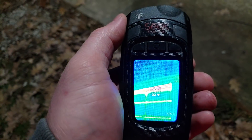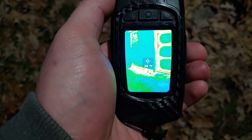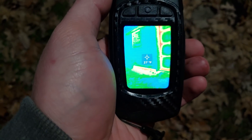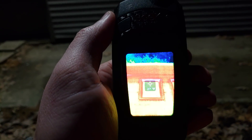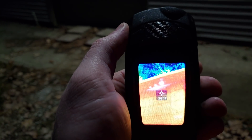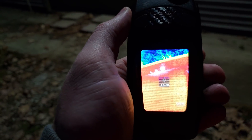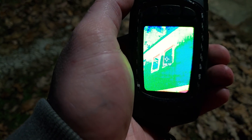You can see my garage door here where it's leaking air around the top, and I'm losing a lot of heat through the slab. A significant portion of the heat I'm losing from the house is coming out through the slab of the garage. Looking up here — this is automatically adjusting — you can see it's warmer near the top. There are three bright things: an LED light on the right, an intake, and a return duct for my heat exchanger. The windows are losing a little bit of heat too.